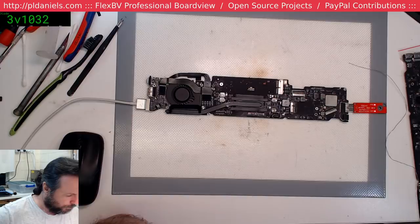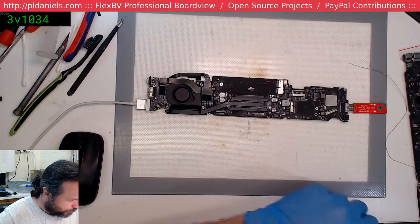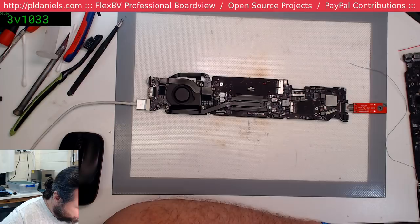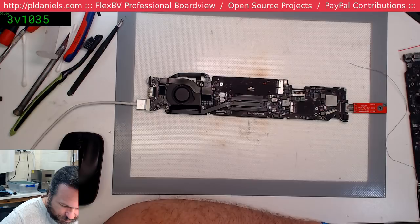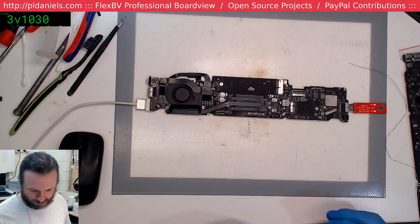Okay. Holy shit, it was actually the BIOS. It's still not working properly though. See how it's just stuck in a permanent spin? So we haven't really solved anything. We've just traded one type of fault for another. Yeah, it's doing the dreaded long fan spin shutdown. I've seen this before on 34, 37 boards. I've never found a proper cause for it.